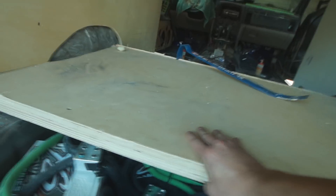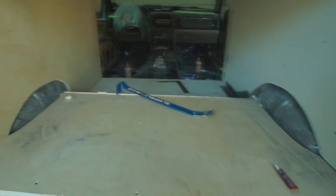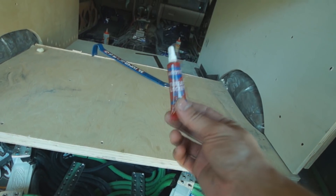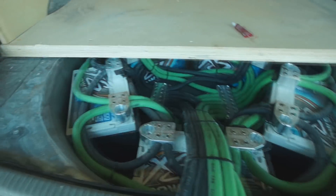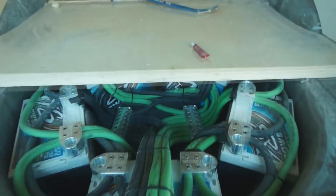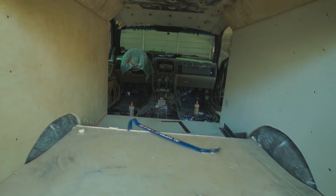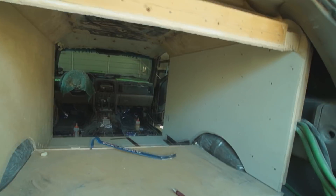Back here I've got this piece glued down. Still got to tie the sides in. I put some thread locker — blue 242 Loctite — on pretty much all of these set screws, just to be on the safe side.